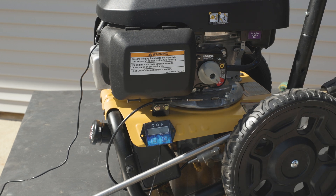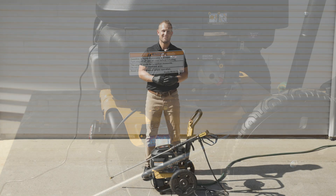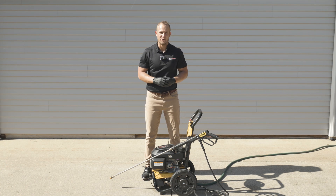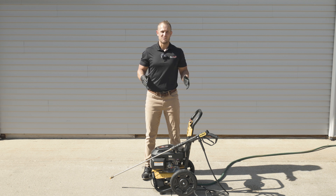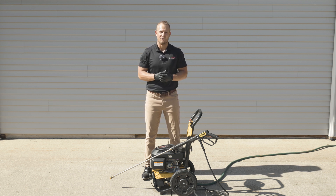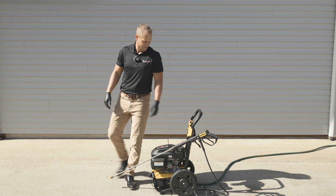As you can see, our engine was set at the perfect RPM range at 3600, and as we let the trigger go, it dropped down into idle in that 2600 to 2700 RPM range. Using a digital tachometer is the most accurate way to set your engine's RPMs. If this video interested you, be sure to subscribe to our channel as we follow up with more videos going forward. Now that we have our engine set to the proper RPM, it's time to get to work and get this unit going.